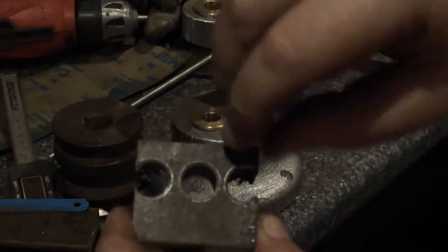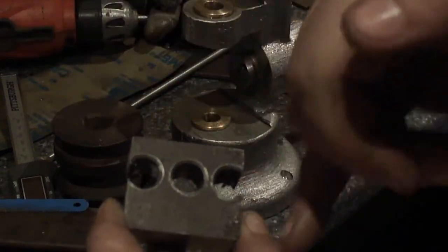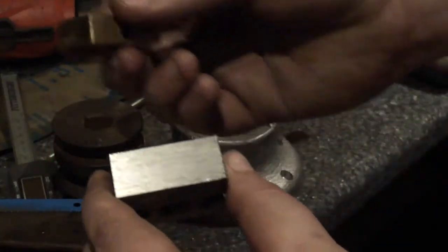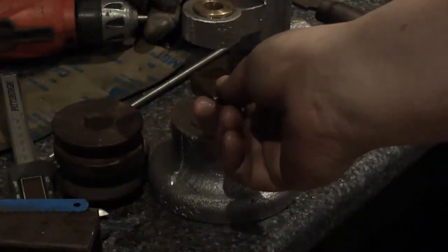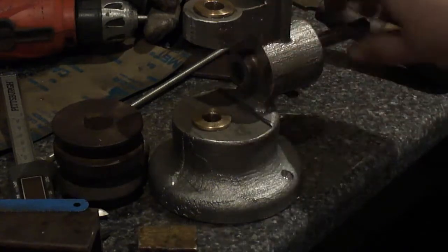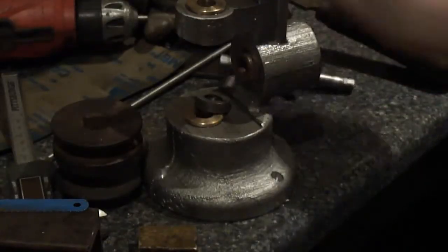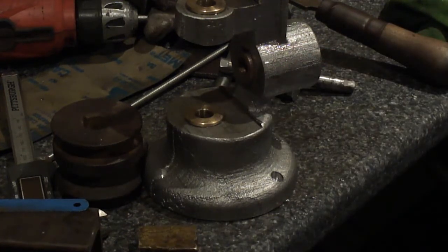I'll trim this off and round it over just a little bit. On the right profile I gotta cut a half inch slot for a brass block to ride in, so it'll slide back and forth in this, which will go on a pin that goes on that. This is not the final rod, it's just stuff I was playing with - it just pops off. I'll machine the whole part out of one inch piece of steel because I've got tons of it.